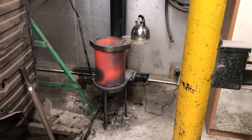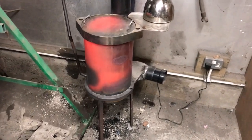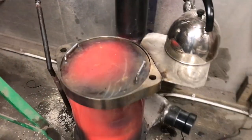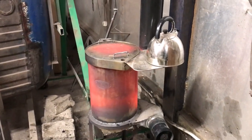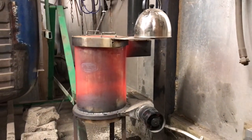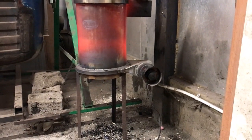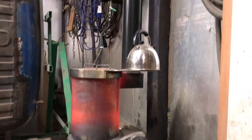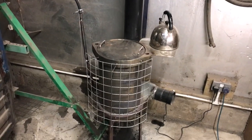These pot burners are not as efficient as ones that atomise the oil, but if the oil is free to obtain then that's a little concern. Mine will use between 1.2 and 1.5 litres per hour according to the temperature selected, which is all controlled by oil flow rate. These things homemade of course can be dangerous, so make one at your own risk. You can buy waste oil burners brand new and they work great, but will set you back a couple grand.